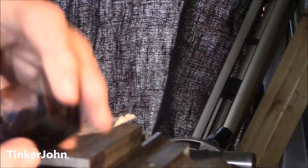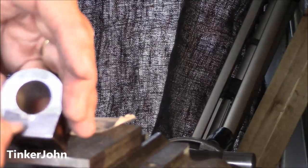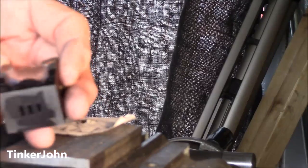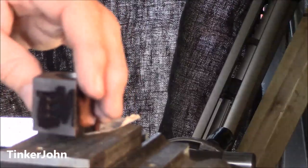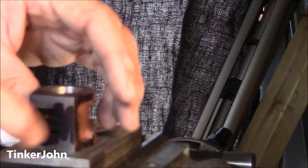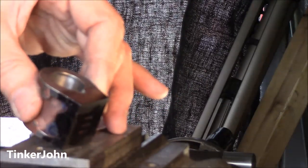I've got the lines and there are the ports that go down, and I'll be drilling a hole in this angle right here and it'll come out about a sixteenth of an inch above the bottom of that. The way I'm going to do that is I'm going to go ahead and put that in, then I will tilt the angle to move this up or down and line this up with the drill press.